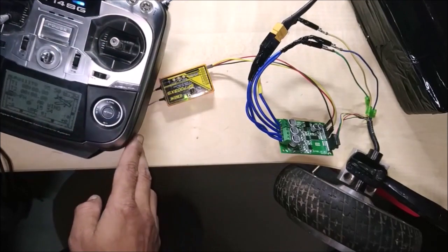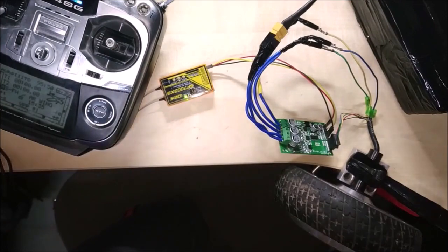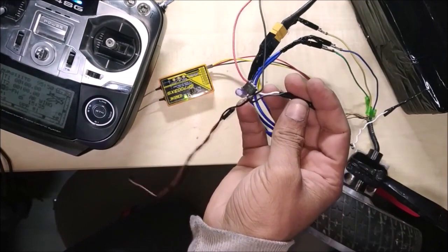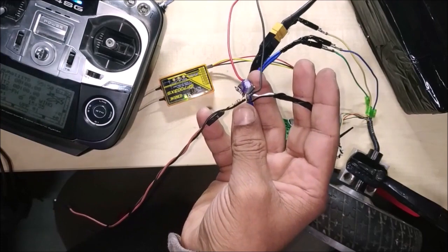This will not work because this ESC needs a high frequency range from 1 kHz to 3 kHz. I encountered this error while working — I thought that the signal was not clear. So I used the concept of a low pass filter and used an LM358 IC for filtering and signal conditioning, but that also did not work.